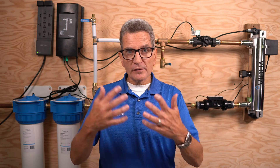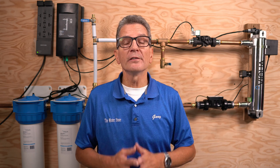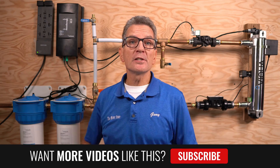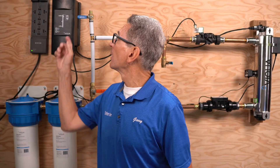In terms of features, I rate the system 9 out of 10. The lamp only needs to be replaced every second year. With the Lightwise technology dimming the lamp, there's much less maintenance because the sleeve has less tendency to scale up, so it needs to be cleaned less often — and the sensor too. It has a countdown timer that warns you when it's time to replace the lamp. It's a fully monitored system, so if something goes wrong, it will tell you what's gone wrong. Viqua has a great troubleshooting portal — link below. The controller goes into alarm and tells you which area is causing concern, with LEDs that flash to show you where to look.